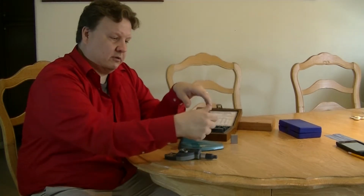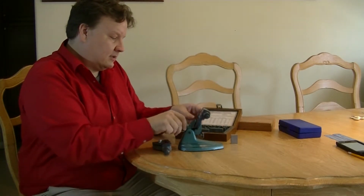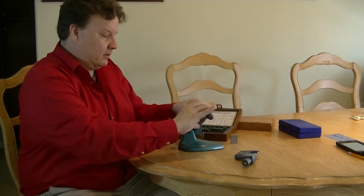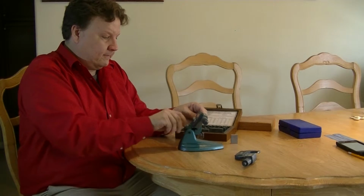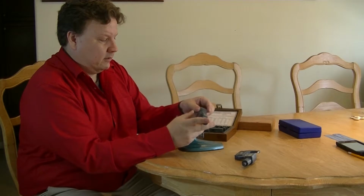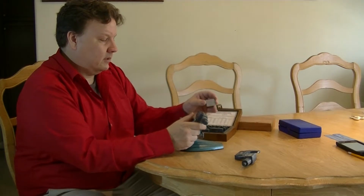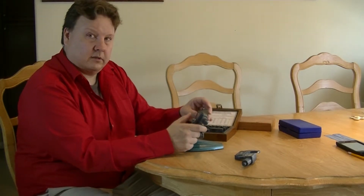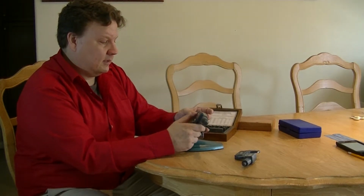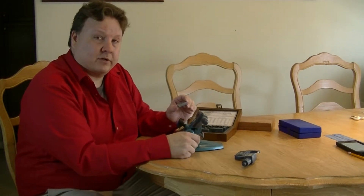Now, with the old way of doing it, you're still moving in and out a large range. And if we used the SpeedMic instead, we'll go ahead and mount that up here. So I mount the SpeedMic on this guy. And now I can simply put the block in there and click the foot trigger. Then I would go into the next measurement, put that in there, click the foot trigger. So that's at least 4 times more efficient.